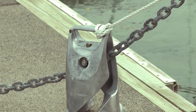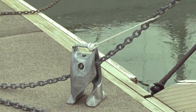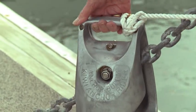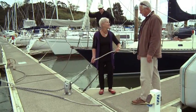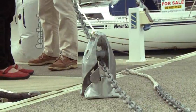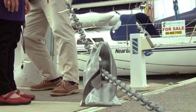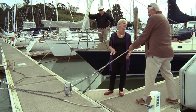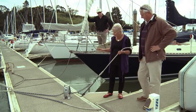The whole idea of using an anchor weight is to change the angle of pull on the anchor to help it dig in. Let me show you how it works. I can lift up this 30 pound or 13.6 kg weight reasonably easily. You see how hard it is when you pull back as if you're the vessel. It takes 147 pounds of horizontal pull to lift a 30 pound weight off the seabed, and that's why they're so effective. It's all to do with leverage and physics.